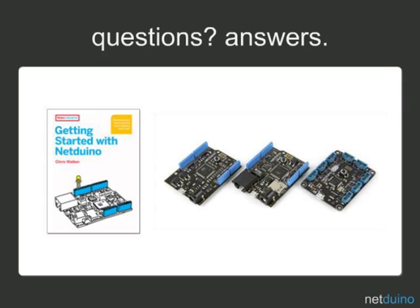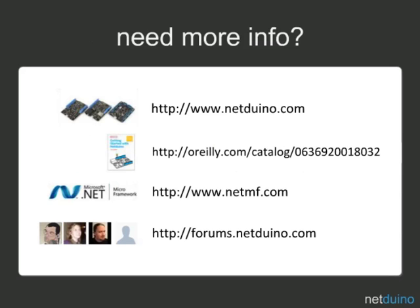As far as its requirements of DLR or not? Do you know? I don't know. We haven't used IronPython on the Netduino, but there was a previous question about other languages, and you could actually run straight up Python on a Netduino if you just blasted the .NET Micro Framework in the CLR, but it's a different approach. Oh, that's a really good point. As far as IronPython, never tried it. Yeah, it's not obvious that it would run on Micro Framework. One would have to try it and fix any programs. I wouldn't expect it to work without a lot of work. I know that PyMite will work, though. And you could actually run Python using PyMite for the ARM Cortex.